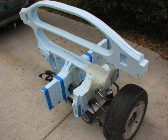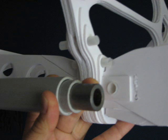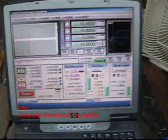This was done to look at the battery box interface to the center bulkhead. Body filler was used to smooth out the layers. This will be done with fiberglass or carbon fiber on the prototype. The structural attach points will have steel inserts inside solid fiberglass tubes. These panels will be cut by a CNC machine. This is a desktop CNC used to build scale models.